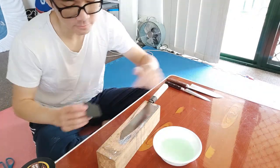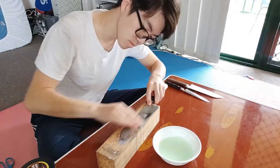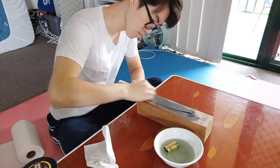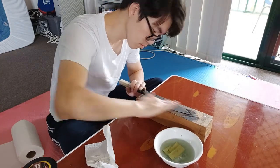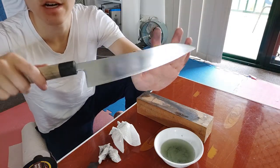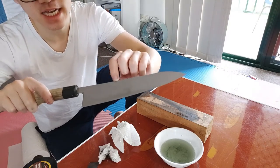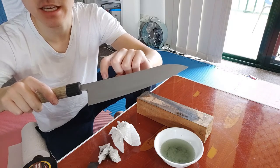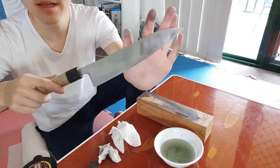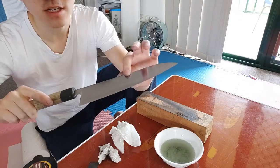So we've got a little bit of soap and water and some high-grit sandpaper — let's let that soak and then sand it down. Sanded from 400 all the way to 1200. There's still some really deep-seated rust pockets that I'm worried about sanding because of the engraving here — I don't want to damage the engraving just to get rid of these rust spots. So I've decided to leave some of them, but I've gotten rid of the bulk and it's a lot shinier. I'm going to hit it with Autosol again to polish it up.